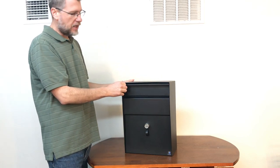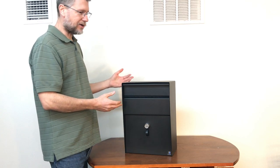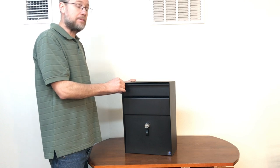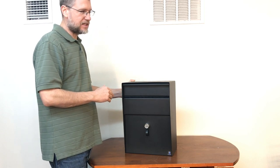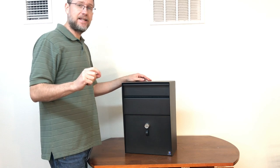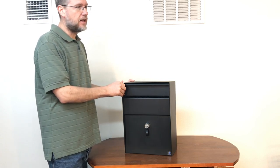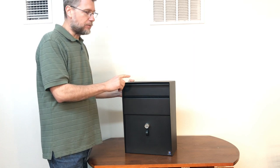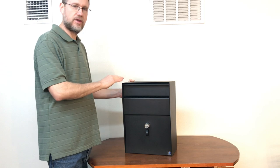This is made out of heavy-gauge steel. A lot of mailboxes you see for $89 or $120 are really thin metal — like a soda pop can — you can just crush and tear them apart. We use heavy 10-gauge steel. The lower the number, the thicker the steel: 20-gauge is really thin, 18-gauge is really thin, 14-gauge is a good standard thickness, 12-gauge is thicker, and 10-gauge is twice as strong as 12-gauge, which is twice as strong as 14-gauge.